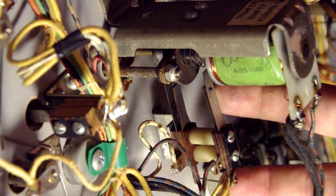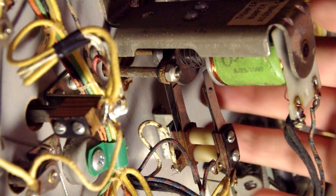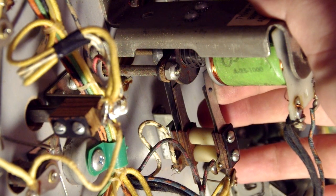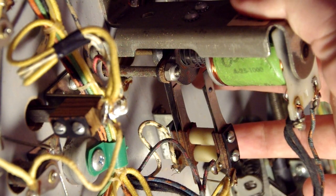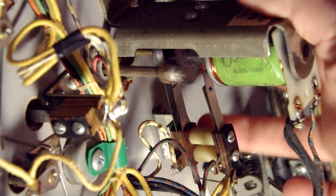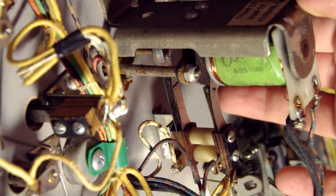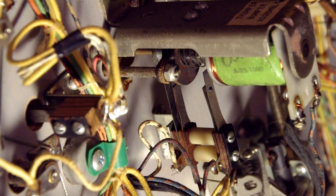This switch is called the end of stroke switch, and it has a very important function. When the pop bumper relay is energized it is actually self-locking, so the pop bumper will force its way down fully and stay locked until the end of stroke switch opens. Basically the coil of the relay is grounded through this switch, so when the pop bumper is activated even just barely it will force itself all the way down. This allows a ball that has maybe just brushed past the bumper to activate it fully, so the ball will still be thrown away at full force. The solenoid moves towards itself and pulls down on the two sides of the ring we saw above — quite a simple mechanism, but hard to work on because everything is so stacked.